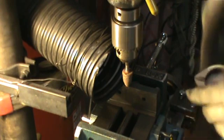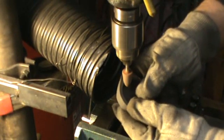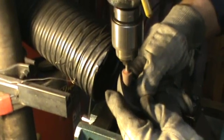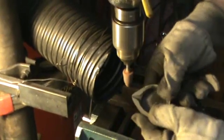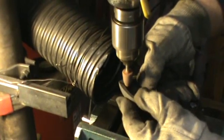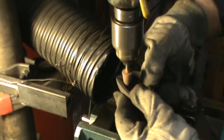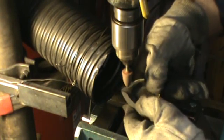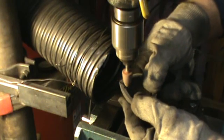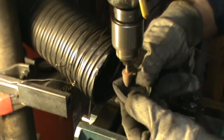We're going to put a little more depth to this — I have a pointed stone. I'm just trying to follow in the little groove I put in with the round file, so I don't get too overboard on this. Because all we want to do is give the gold or silver a good little channel to start from. I'm going to finish this out with the round file once I get the majority of the graphite smoothed out of the way.